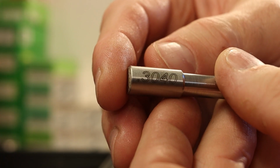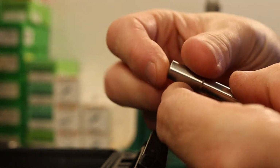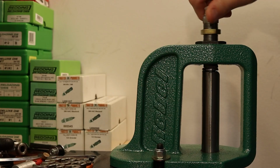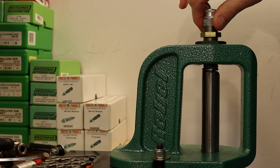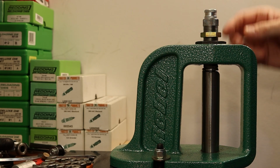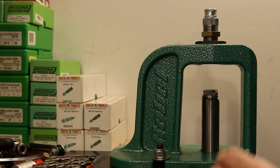Now for 30 caliber, I got their full set, extremely expensive, but I've got mandrels that go much smaller, like that's a 3040. They're in half thousandths increments. Let me find you one. There we go, that's the next one, 0.3045. So it gives you a lot of control if you want to play around with neck tension. So even if you don't subscribe to the idea that expanding necks separately is going to lead to better ammo, it at least gives you much better control over your neck tension.